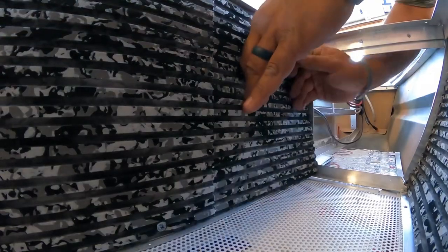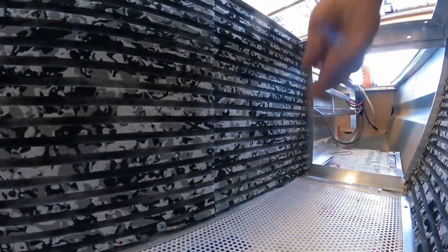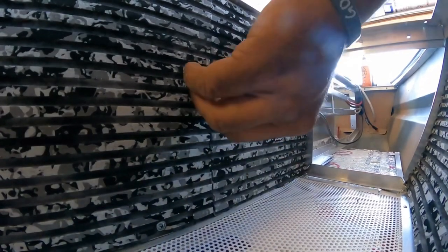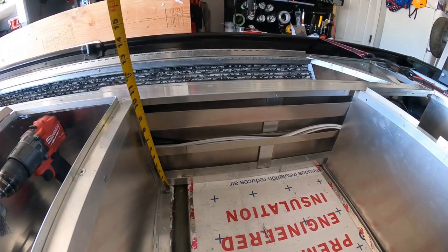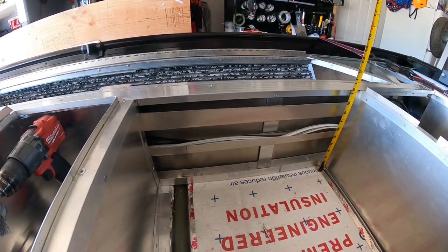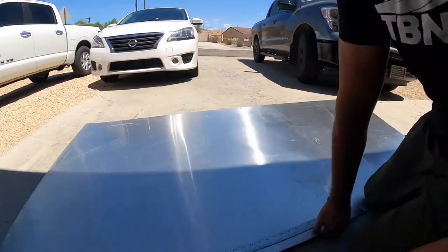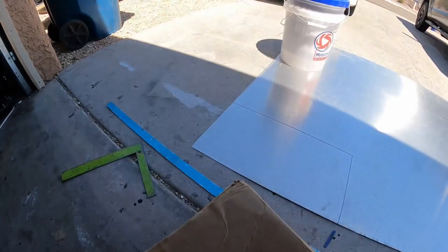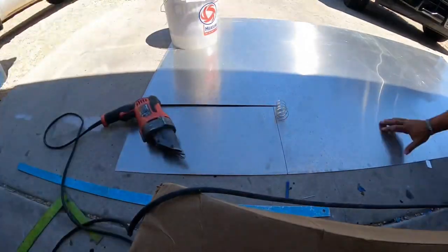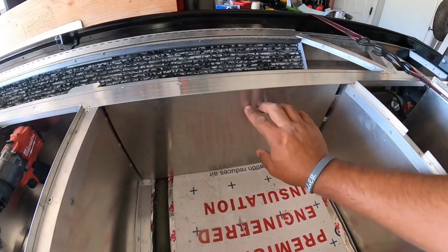They're surrounding the main serviceable panel. The big giant panel we put on there is the serviceable one that we will use at will to modify any electric stuff going on. That's the main electric conduit wall. For the main electric conduit walls, we use the 0.040 because it's slightly thicker. It's a little bit heavier. I don't want to use 0.040 for the whole thing though. So we got this generous 4x10 0.025 sheet. It's about the thinnest sheet you can get out of aluminum without it completely tearing apart and destroying itself.